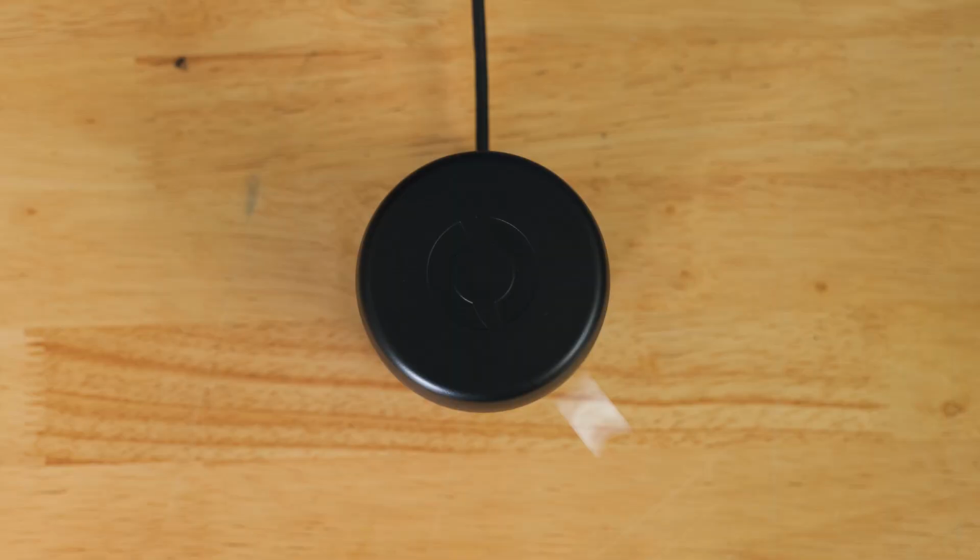Inside the Ping360 is a transducer that emits a narrow beam of acoustic energy and then listens back for echoes. That transducer is mounted on a motor that rotates it in 1-degree increments, and as it does so, it generates a 360-degree image of the surroundings.